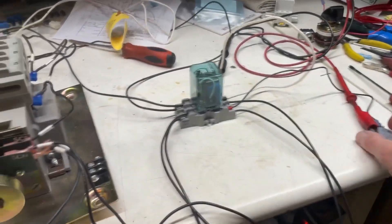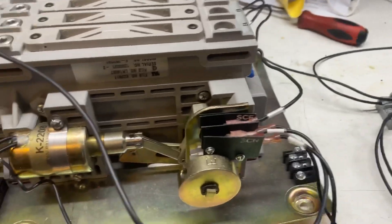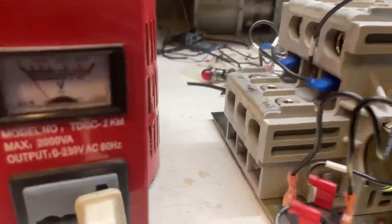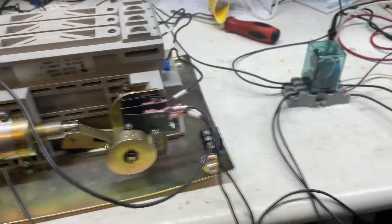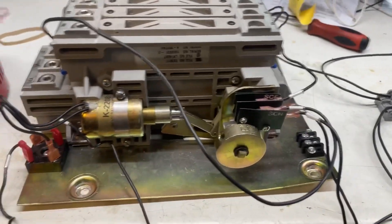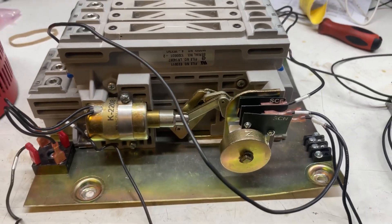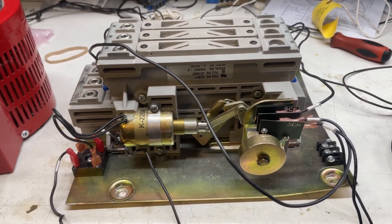This is now part 2. I have to hold now because we're now on emergency power. Now I have to turn this switch on, and now our ATS board is going to drop out the relay — which is this switch here — and it transfers back to N. And that's all she wrote, we're good to go.